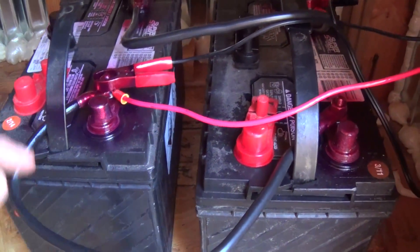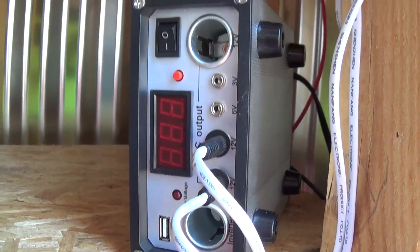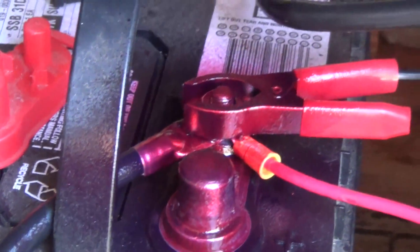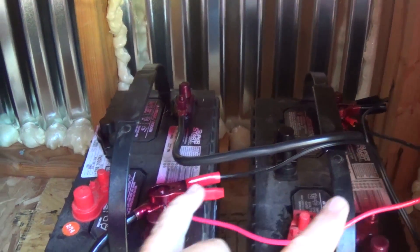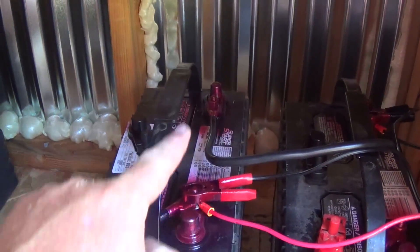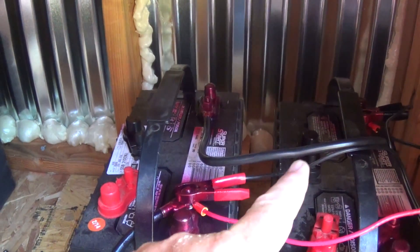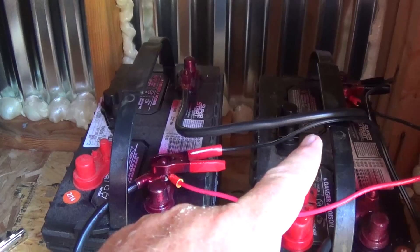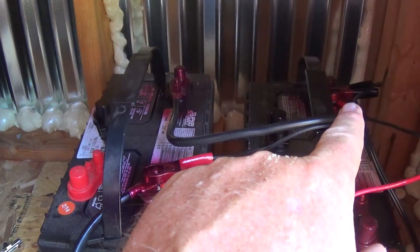Now how do I charge it? This clamp here is coming from a charge controller - one of these Harbor Freight charge controllers. No panels are hooked up so you don't see anything. The positive lead is going to positive on what I'm calling battery number one, and the negative I'm putting on battery number two. The reason is that once you hook it up in parallel, this becomes one 12-volt battery - volts stay the same, but the amps will double. It just allows me to use lighting or charge some cordless batteries from these. Positive to number one, negative to number two - that's my charge controller.